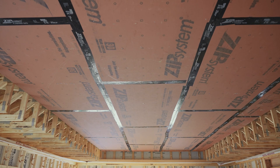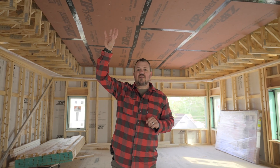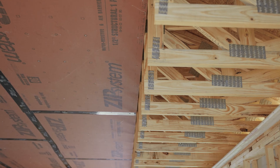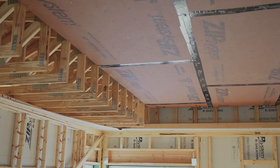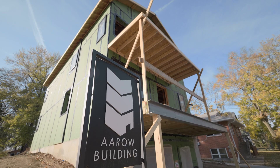The reason we have ZIP sheathing on the ceiling of the plenum is so it'll be inside our envelope but outside the visible space from our clients. This plenum will hold our ductwork and our ducted mini-split system — that unit only takes up about 12 inches. We have a 14-inch plenum, and we have the ability to frame a false ceiling underneath that. Now all of our ductwork is inside our air barrier and our insulation. We don't have an HVAC unit trying to push conditioned air through an unconditioned hot or freezing cold attic — everything's inside the envelope. The system doesn't have to work as hard, doesn't have to be as powerful, and doesn't have to cost as much, because we've partnered it with good deliberate building techniques and good material choices — our ZIP sheathing, Anderson windows, and air control layers. All of this performance package comes to play on a modestly priced, well-built home.